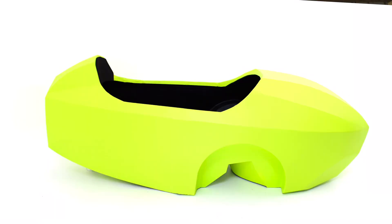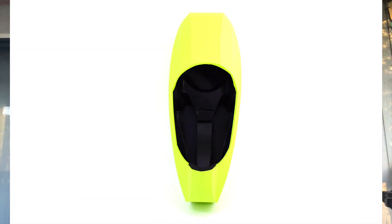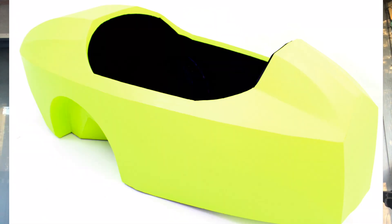This centres the idea that it's probably going to be more of a practicality-based purchase if you're interested in this fairing. We've also focused on compactness, despite having lots of room in there for a larger rider. This machine is only 2.2 metres long — it's actually shorter than Roto-Valoe, which is already shorter than many velomobiles out there. The focus of the short length is that it makes it more compact for storage — it'll fit upright on its end in a normal-height-ceilinged garage and could be easily transported in another vehicle. It also keeps surface area down so we can keep the shell at a reasonable weight. We expect this shell to be similar to the existing Roto-Valoe shell in weight, despite being for a larger rider.